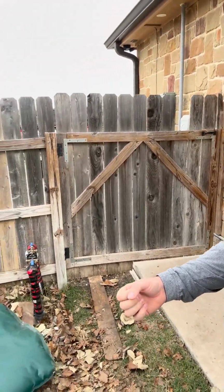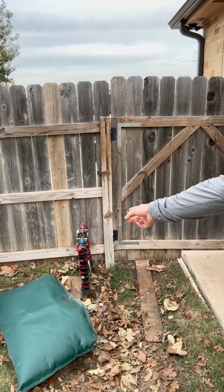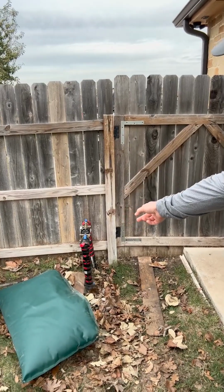So then we have over here what's called a backflow prevention system. This backflow preventer is what is preventing any water from going back into potable water sources to your neighbors and throughout your community. This is very susceptible to freezing. When we have a quick freeze, it's not the end of the world. You know, the overnight freeze where we're back in the 60s, just like we do in Texas, that's not as big of a concern. It's when we have freezes like the ones coming up in the next week that cause us a lot of headaches.